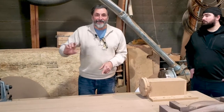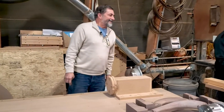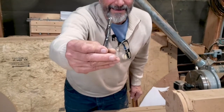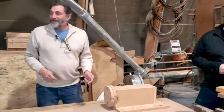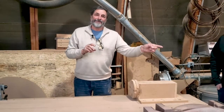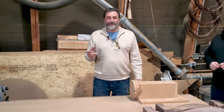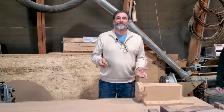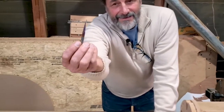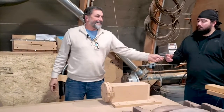We're not talking about a five-axis machine with a dedicated profile cutter that just mills the profile on the side or top. Get one of those half-inch ball nose cutters — this is the guy that does almost all my work. It's a half-inch ball nose. If the handrail doesn't have any little beads or fillets that can't be reached, I can make the whole handrail with that one cutter. If I have to cut a bead into something like the 6010 rail — it has that little bead on the bottom side — I have to use this real small tapered cutter, only a sixteenth at the end, to get into the little creases where the half-inch ball nose can't reach.